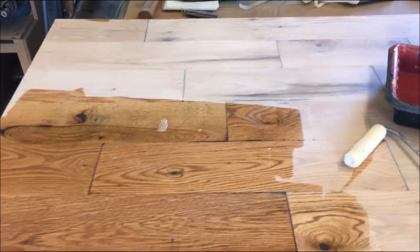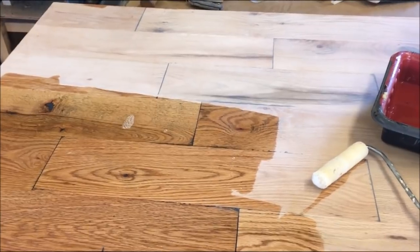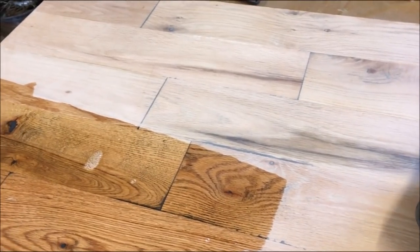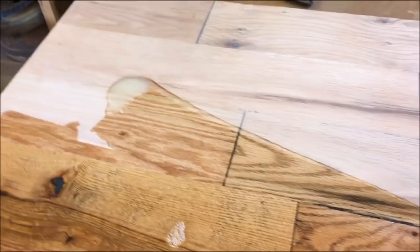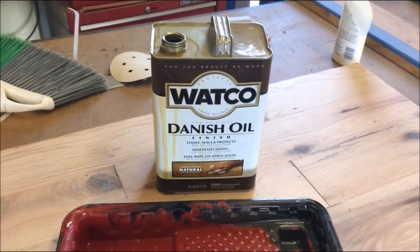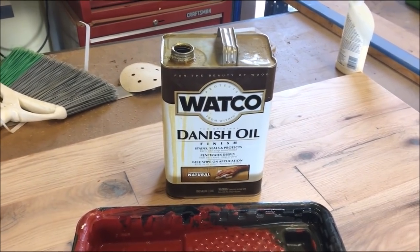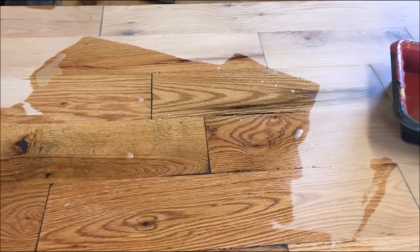I've just sanded it and I'm at the stage where I'm going to put a finish on it. It's still got a little wave to it — it's not dead flat like I would typically do for a dining room table — but this is designed to look old, like I found it laying out back of a barn. So this is what I'm putting on it: Watco oil. It adds a nice amber tone to it, and you can really see that. The instructions say to flood it for 30 minutes, keep it wet, and then wipe off the extra — and that's what I'm going to do.